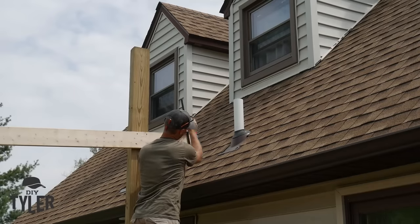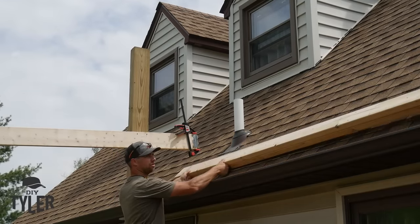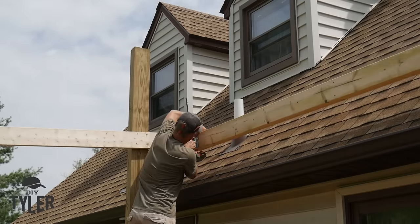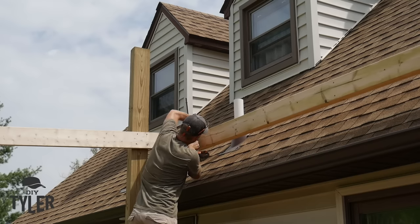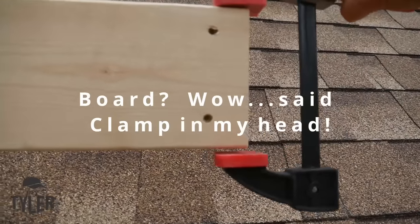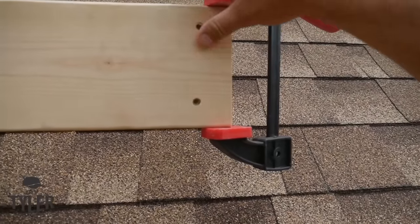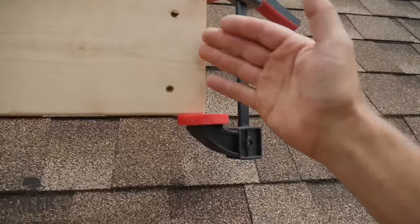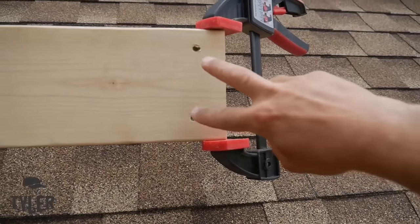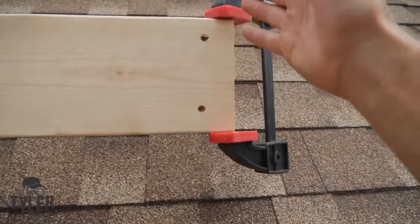In the intro I mentioned two double header portions of this pergola roof, but we changed halfway through because we were short on boards. So the cantilevered portion has a double header, and the middle where the roof supports join together right over the middle of the room is only going to be a single board. Using a board to hold things in place while moving them is really handy if something's heavy or awkward. Here we're bringing up a board that needs a hanger because this is a double header, so we'll use a clamp kind of catty-cornered to hold it.